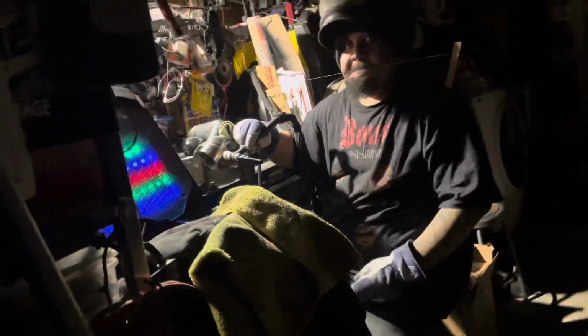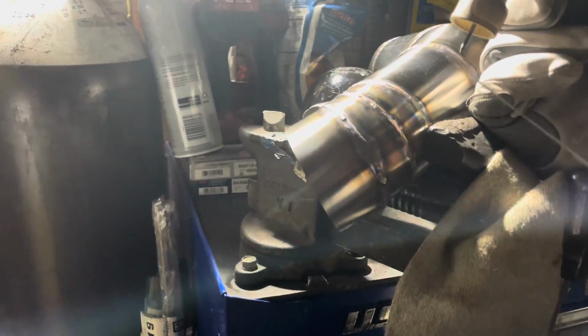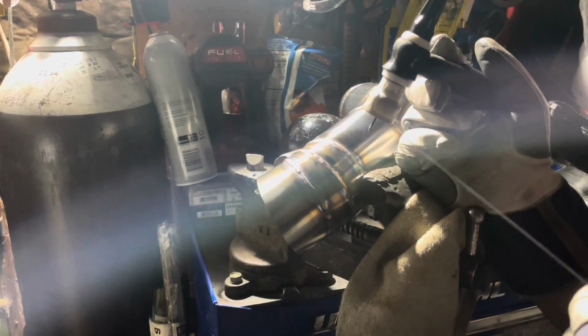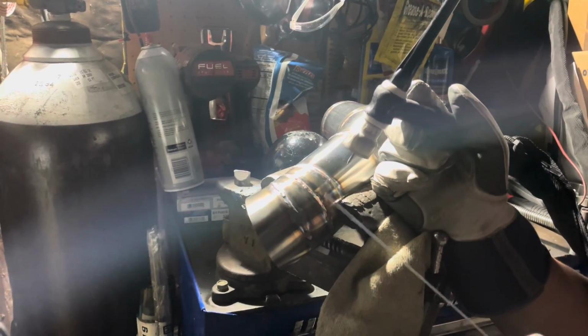Are they getting too hot? Does it get too hot, or why do you leave it like that? It's called shielding the arc. After you finish welding, you need the weld and the tungsten to cool down. So when you let off the pedal, the argon still flows. It's called post flow. And the argon is what's cooling down the weld and the tungsten.